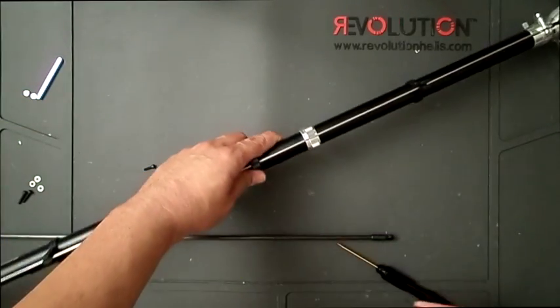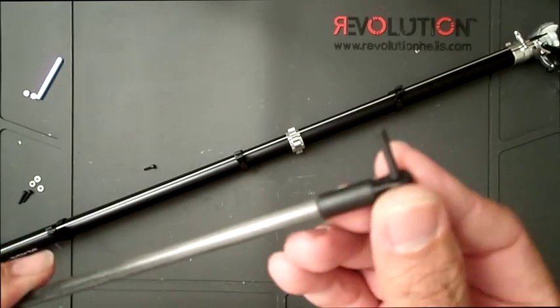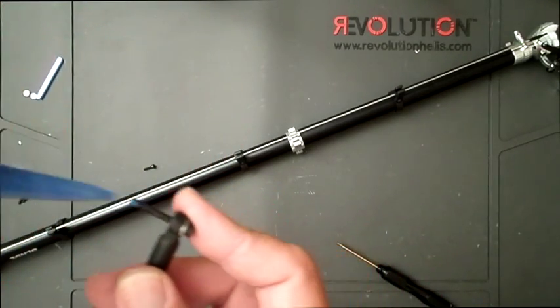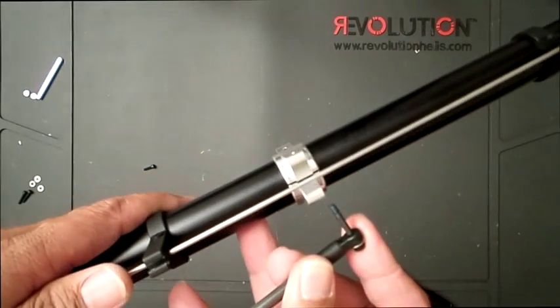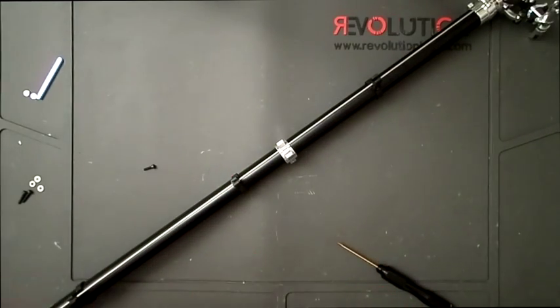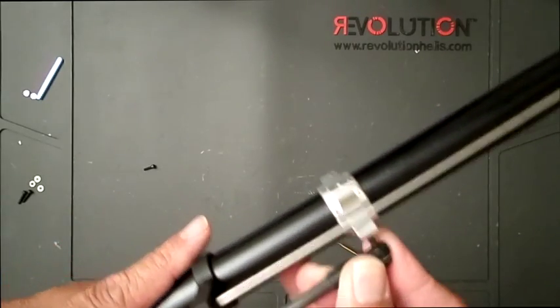Okay, so before you do that, you need to put a boom support right through and get some Loctite on there. Okay, so insert. Actually, make sure there's good enough Loctite there. Okay, so these boom supports are notorious for loosening up, and if they do loosen up, pretty bad things can happen. So make sure there's ample Loctite there.